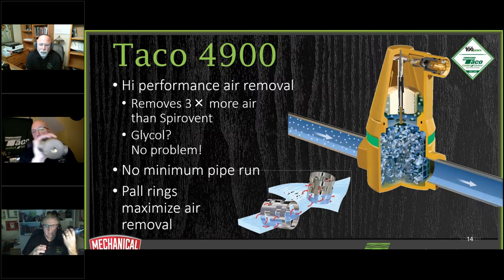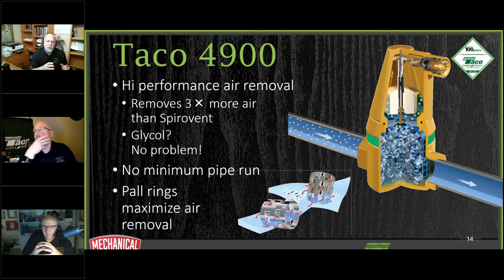Somebody was, when we were talking about that other location before, saying they're worried about putting the makeup at a point where the pressure could change and drop to the point where it would let more water in. That's a given, right? That we want the makeup to be at the point of no pressure change. But that's where the expansion tank meets the system, not necessarily where the air separation device is. So again, a picture's worth a thousand words, but yep.